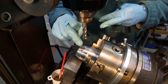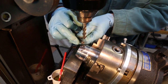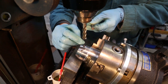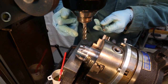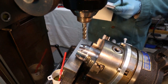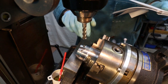All four 6.8mm holes have now been drilled around the periphery of the hub. I've checked their depth to make sure the drill hadn't slipped in the split collet — all are to the correct depth. This material will be used for making the handles. The 6.8mm holes will be tapped M8 and I will cut an M8 thread on the end of the bar to screw in. Because we're going into a curved surface, the thread will tend to be visible at the edges as they're lower than the center, so I want to put a spot face on there — a level flat face. I'll use this cutter which is 9.5mm in diameter — that's a 3/8 inch imperial cutter working out at 9.52mm — giving us a nice spot face for the handle to butt up against. Four spot faces to do.